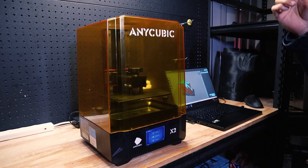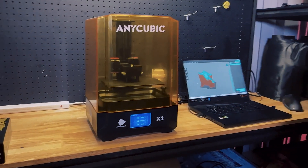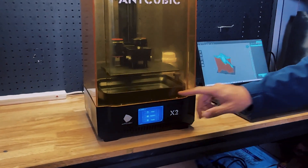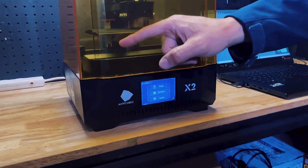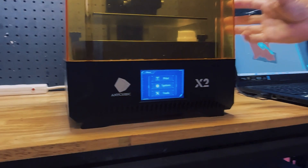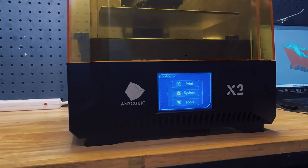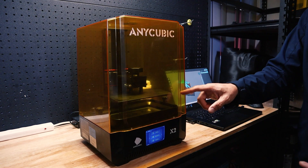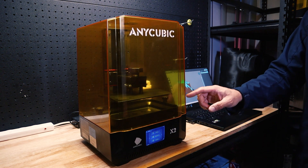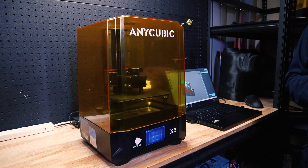Thanks Charlie. I've had quite a bit of time with this printer and I've had some ups and downs. The downs, unfortunately, were pretty dramatic. The vat that it came with, for some bizarre reason, had a bit of a leak right around the rim of the plate that locks the FEP sheet in place. It was a very slow leak, but unfortunately it was not noticed in time to catch it. As a result, the resin went into the guts of the LCD screen and pretty much destroyed it. So we've had to go hunting for a replacement LCD screen.